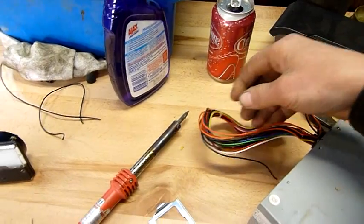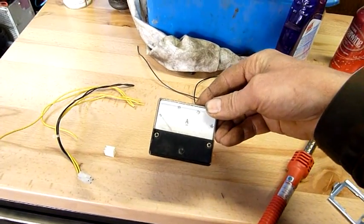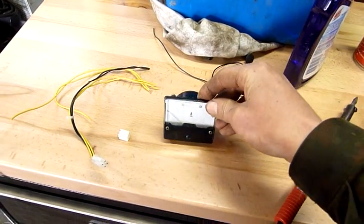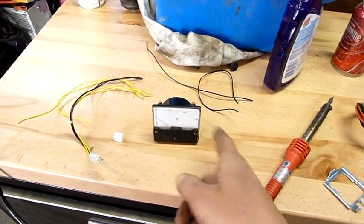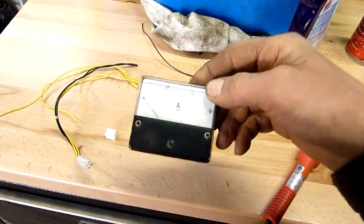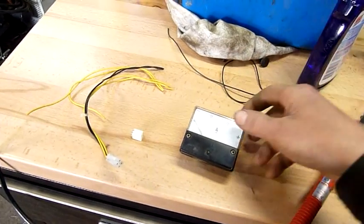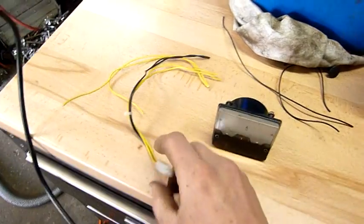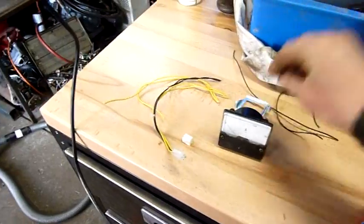The main 12 volt out of my power supply is about 40 amps, so I'd have to select a specific rating of meters to get an easy or accurate measurement of how much current's going through it, because if the graduation's too big like this, the needle might be sitting here but you can't tell if it's 0.1 amps — it'll be like 1 amp or something. So anyway, I'm going to solder this connector up, put some ring terminals on it, and just shut the PC down and we'll plug it in.